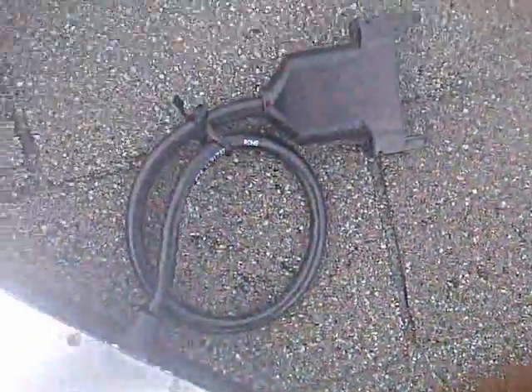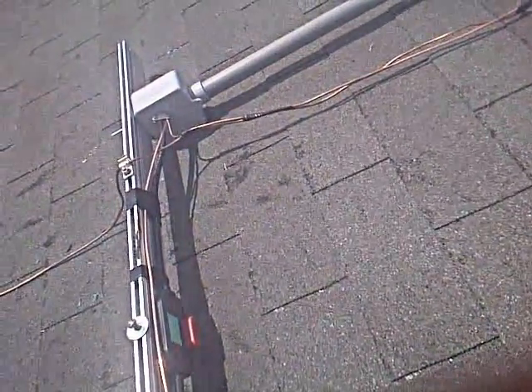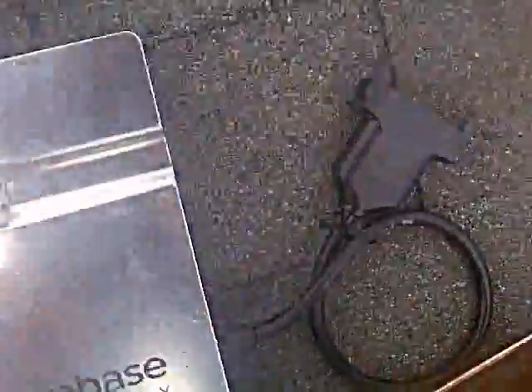Before, we used to be able to just plug inverter one into the other, which I actually like better. But now they have us run a cord which has connectors on it. And you terminate your cord back in the junction box there — that's your 240-volt with the neutral and ground. That goes back to the electrical panel. What you do is take this connector here after you run your cord, and you simply plug it in here.